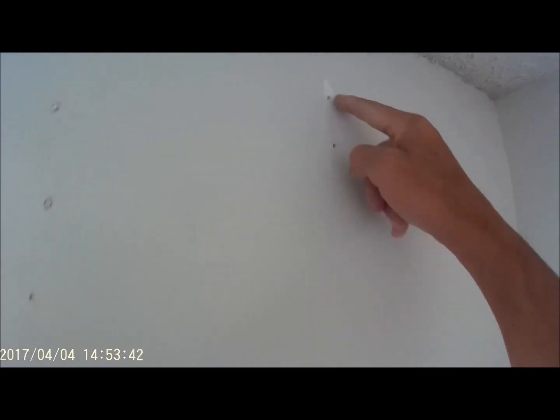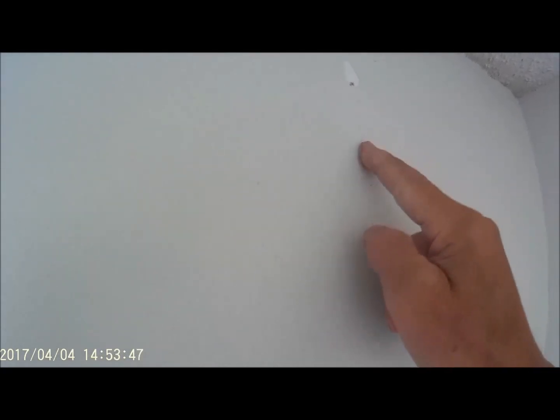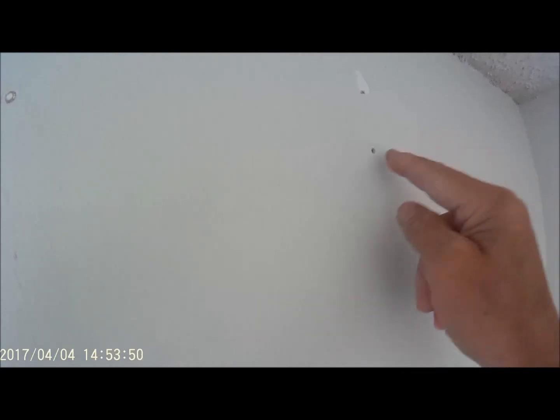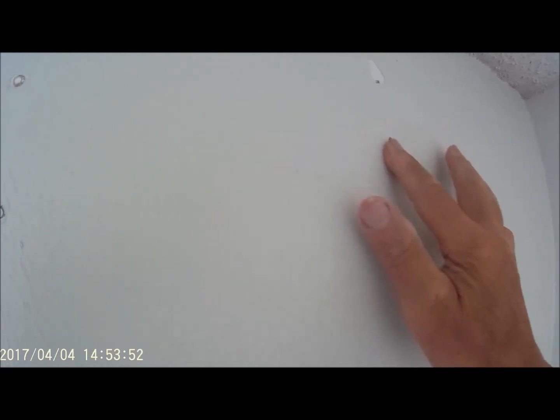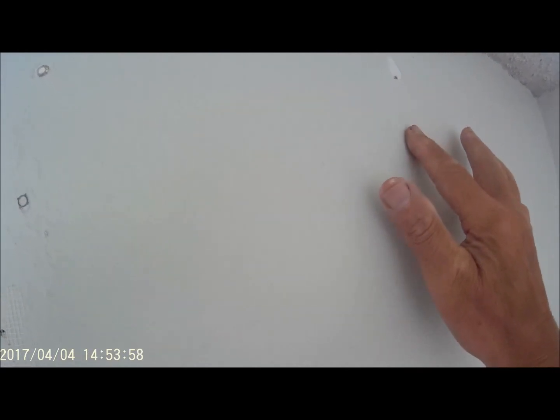Now, this is going to be another example. These are 2 holes, and they're borderline. If you tape it, you have to do 2 or 3 coats, typically 2 coats. You can fill this, and when you rub it out with your cloth, you avoid washing out the hole. So I leave the mud in the hole, and I wash all around. Now when I rub it, I know the hole is here, so I just rub around the hole. Look, there will be a little variation right there where the hole is. But you know what? It's so small, it's still not going to be noticeable.